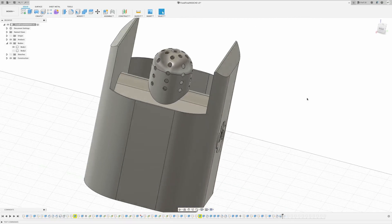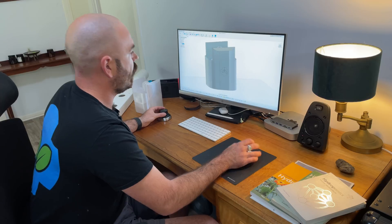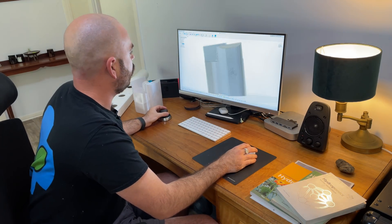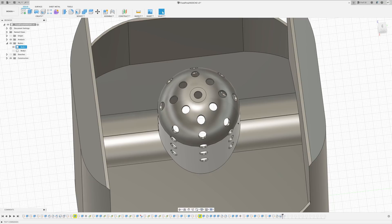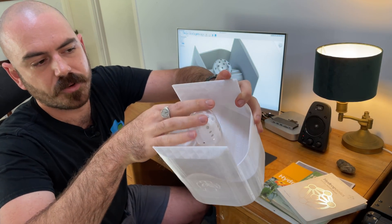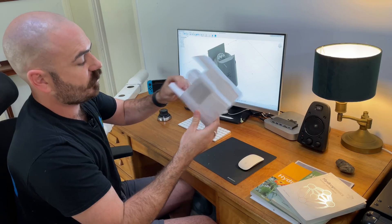To achieve this, I had the internal of the bucket come up at a 45-degree angle from the side as it prints. This allows the printer to build on existing print layers rather than just hanging out over in free air. In some of the early models, I had bridges along this point which weren't working at all, so I had to make this a domed shape to account for places where the bridging wasn't reaching across and caused the filament to fail. The print is designed to be printed in one piece without supports, and I've achieved that fairly well.